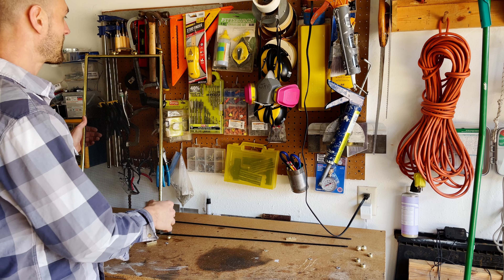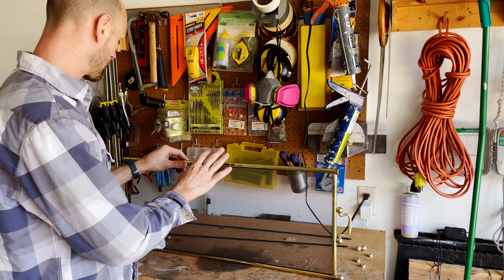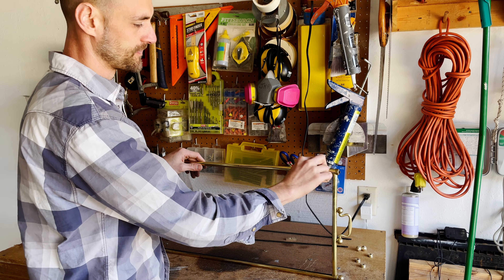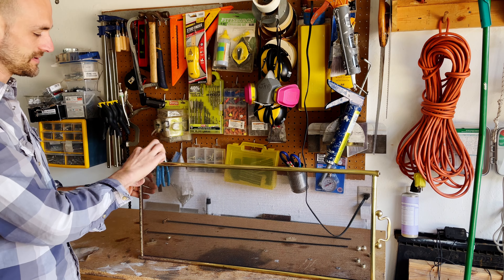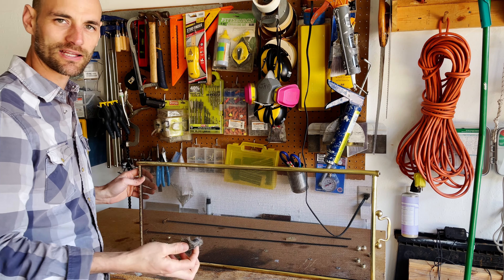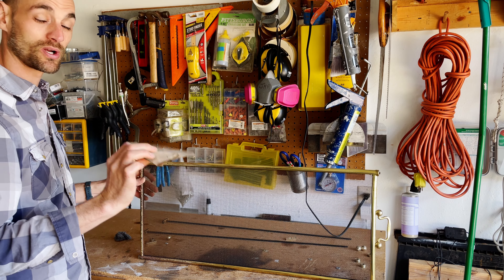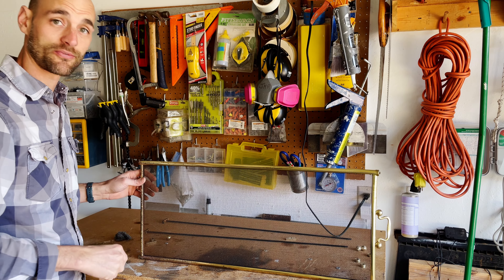Here's my final piece of the three pieces of this screen. What I'm experiencing is that when I use the steel wool towards the bottom, for whatever reason on every one, it almost becomes more of a polish and stops scratching the surface. So I started using a 120 grit sandpaper just to scuff it up, and I'm going to finish it off with that.